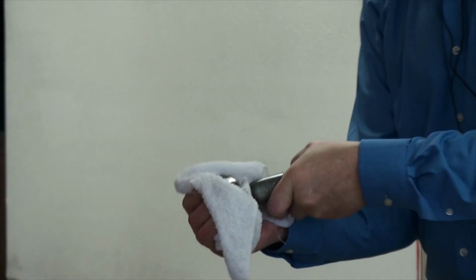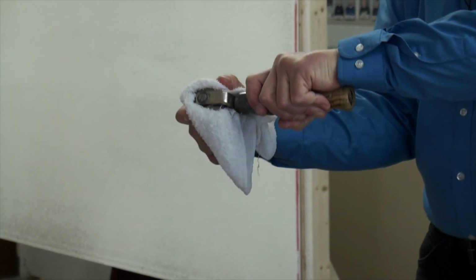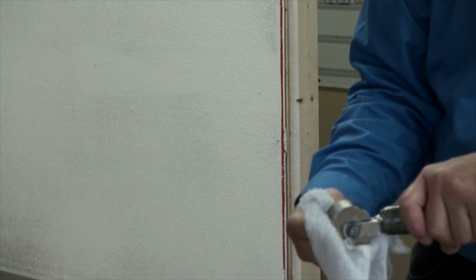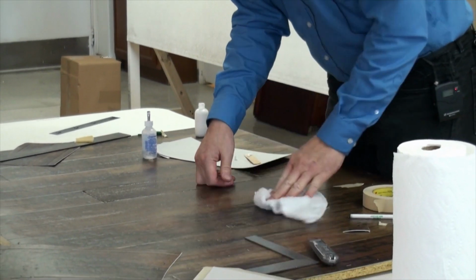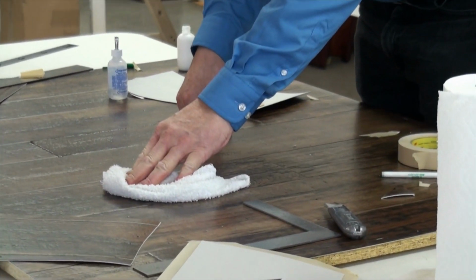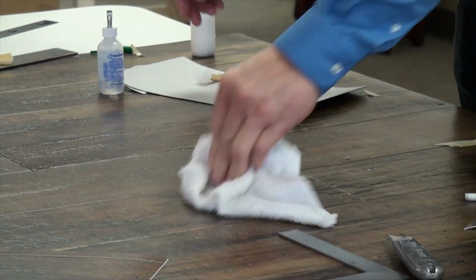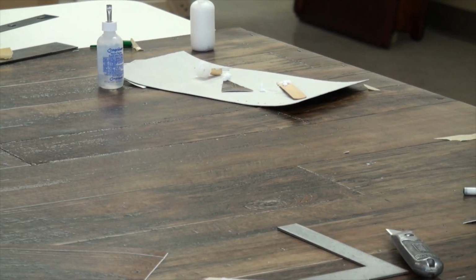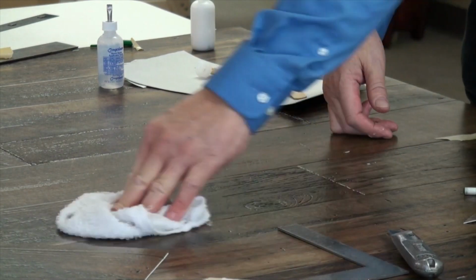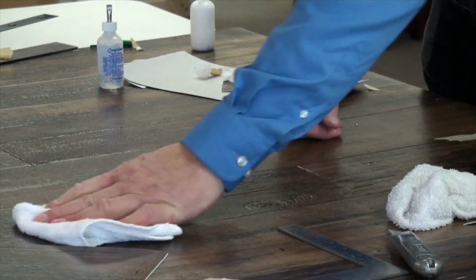You'll wipe this clean, you'll remove the adhesive or the bond and seal off your brand new seam roller that you just paid $21.80 for. You'll clean the immediate area with your terry cloth towel, and yes, a t-shirt works if that's all you've got, but make it damp. Do not use a paper towel. Don't go in the bathroom and get the C-fold towels and expect this to work. Use a terry cloth towel and wipe that wet, and then take a dry one and chamois it off dry,